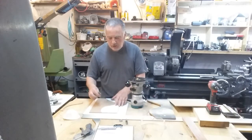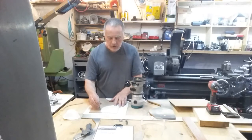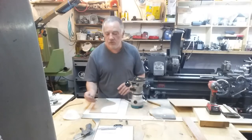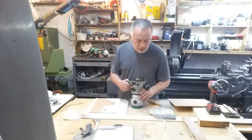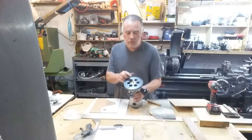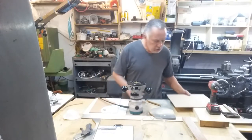So that's the finish line you want. Your templates and your template guides and bushings — all they do is move the router bit for one cut on this side of the line. So the way you figure out what you need: you don't have to worry about the offset. Put whatever router bit you want in there, put your template guide bushing in here, and the best thing to do is just do a test cut and measure the gap.